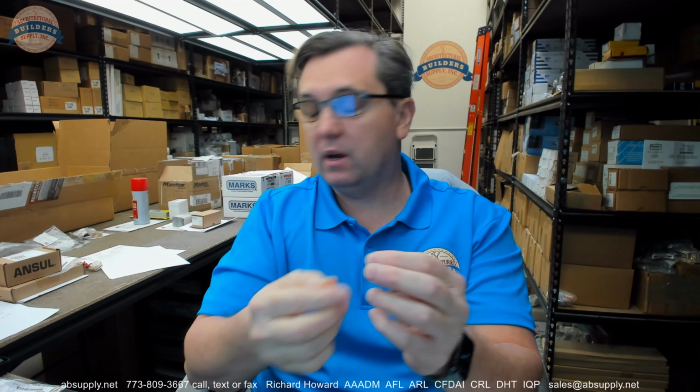Look at the Schlage L583-056 catch pin. This is a steel, a ferrous-based at least, steel, I think it's zinc dichromate. It has a bit of a gold tone to it. What they call a catch pin, and it works in mortise cases. It will give you an axle by which other parts will operate.